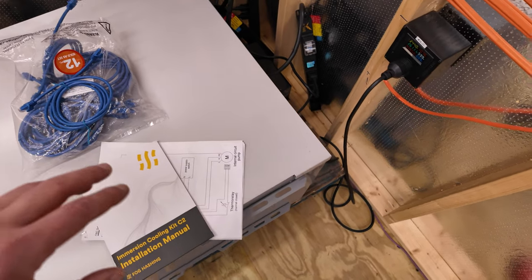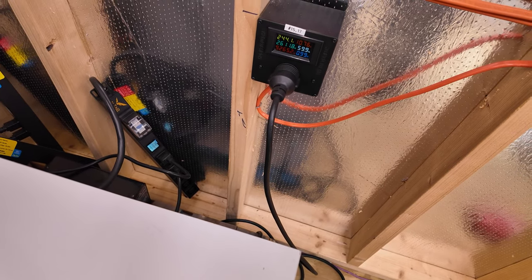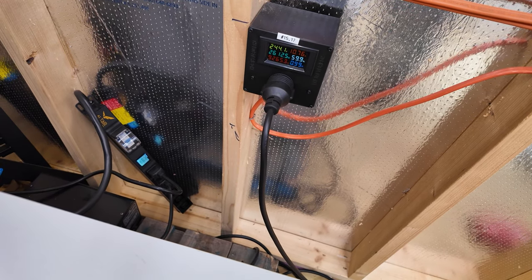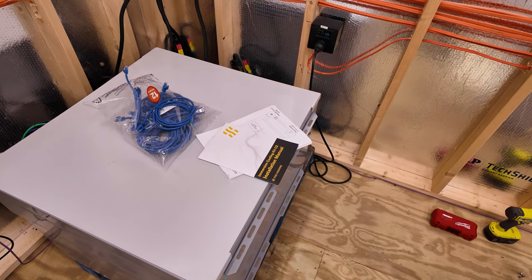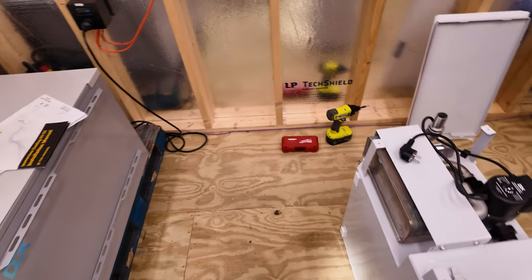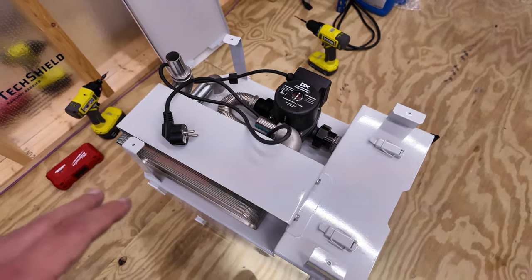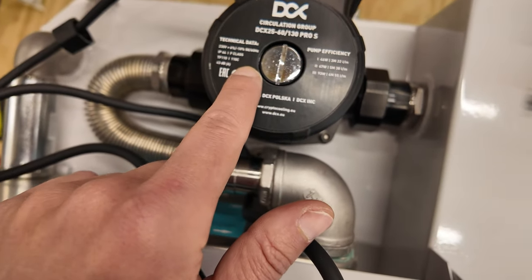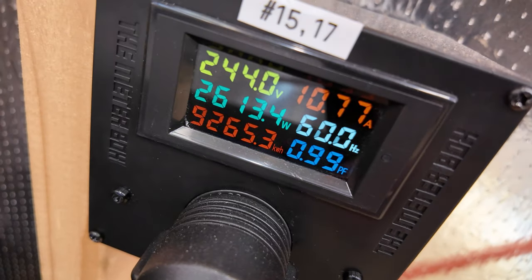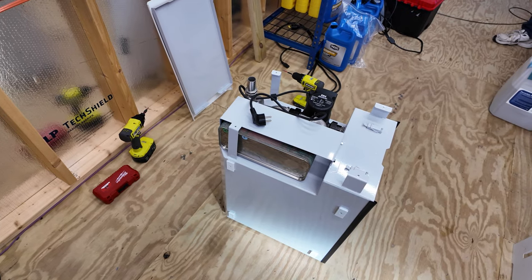And this setup has led to a big inefficiency, where this whole system is drawing 2,600 watts, excluding the miners, just to run and operate, which has resulted over the last several months in an operating cost for me of about $930. It's essentially a ninth miner that I have to run power-wise in this eight miner system. So I'm hoping we can get much better efficiency bypassing a transformer. They recommend a transformer due to their pumps in Europe, because this is a Polish designed device, to be rated for 50 hertz. However, right here on the pump specs, it's 50-60 hertz. My electricity is 60 hertz, as you can see on my gauge right here. So this should be well within spec and be just fine, and it's gonna be a little bit extra work, but it should be worthwhile in the end.